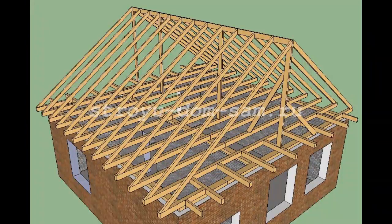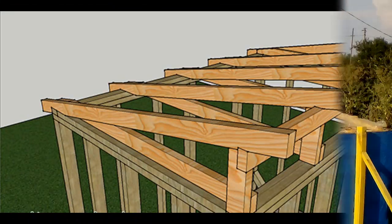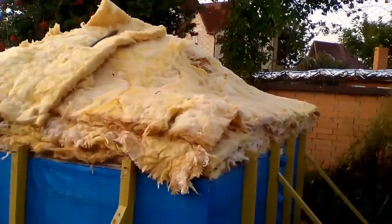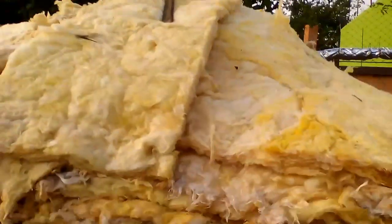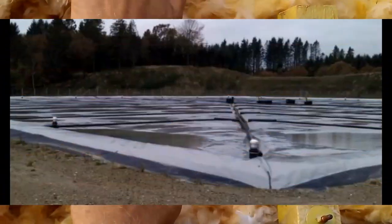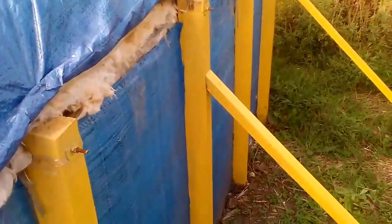The frame of the roof must be standard and must resist the pressure of wind and snow. This liner is placed on the frame, then thermal insulation is put on the liner — but mineral wool is a poor alternative and the insulation must be installed from expanded polystyrene plates. The roof is covered by a liner similar to those used on European storages, and the liner edges allow wind to ventilate the roof insulation, but rain should not enter here.